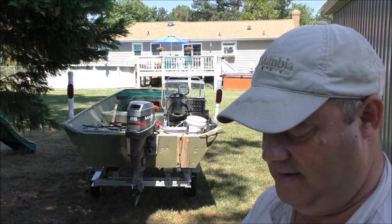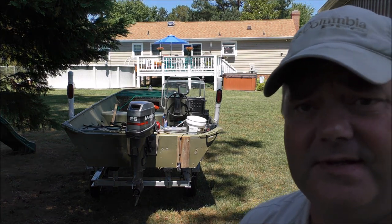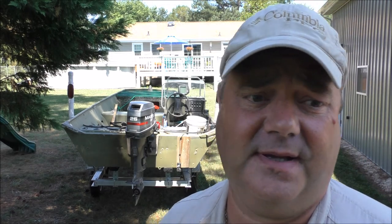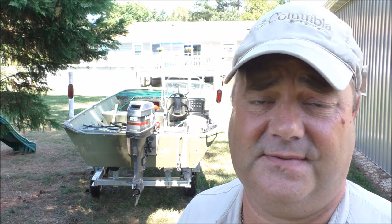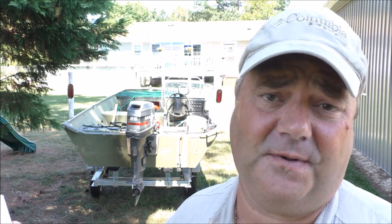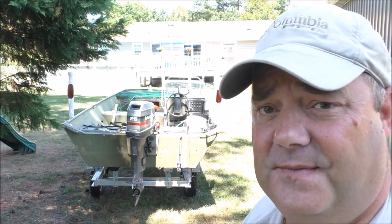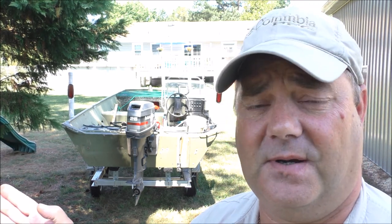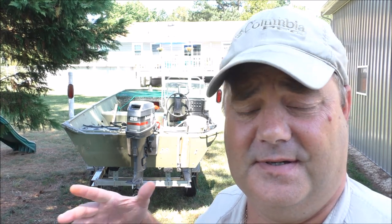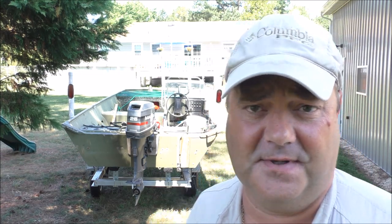What's important is keeping these things out of the water — lights go bad every time you turn around, bulbs fail, you're tracing grounds constantly, it's a pain. Get them up out of the water and you can see what you're doing when backing up. Plus the PVC pipe acts as a guide-on at a bad boat ramp — your gunnels hit the sides of the PVC and guide right up onto your boat trailer.